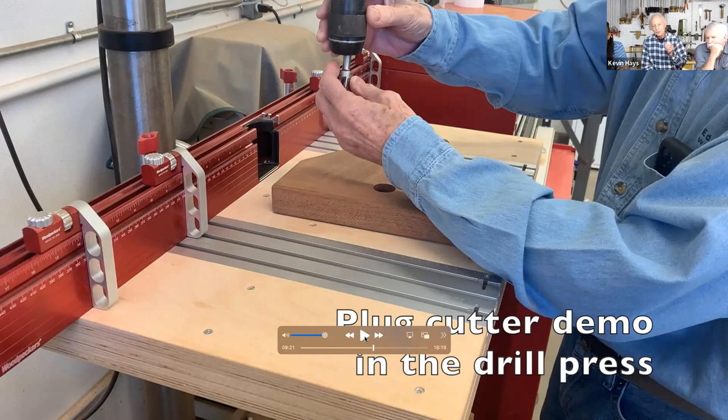Yes. If for some reason it won't drive your screw in, and you've done everything, you've drilled your pilot hole, always back the screw out, change the torque setting one or two times, and go back and re-drill. Don't try to change the torque setting and then continue driving it in, because the screw's already locked inside. That's just a good rule of thumb, because you run the risk that if you've torqued it too much, now you've stripped the head off of a small screw.